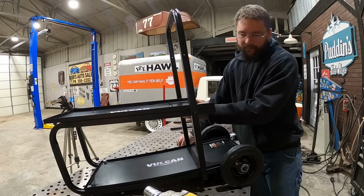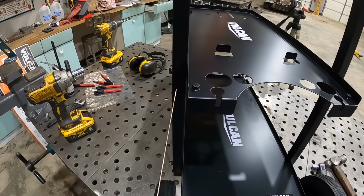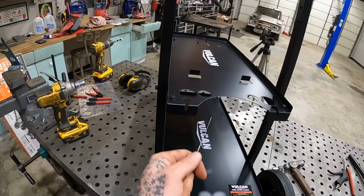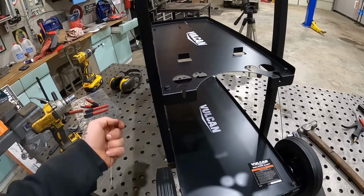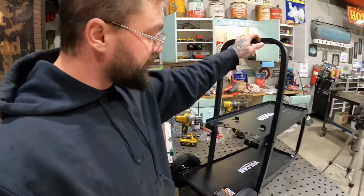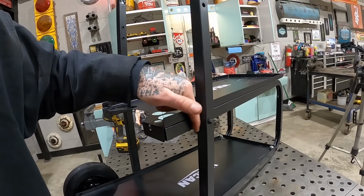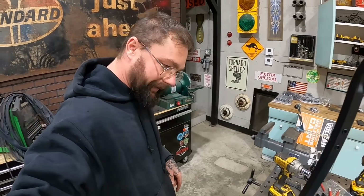Definitely put it together wrong because those nutserts stick out just a hair. Not much, but I can start to shove that little piece of filler wire in between there, where had we done it the other way, that should go flush, I do believe. It would have sandwiched everything much nicer. The good thing is this is all made out of metal, and that's very close. So if that ever gets rickety, I'll buzz a weld down it, no problem. I'll buzz a weld lickety split.